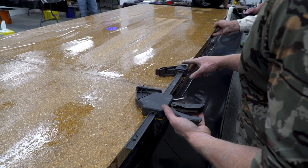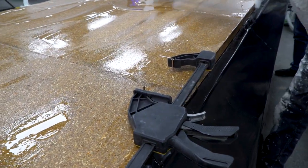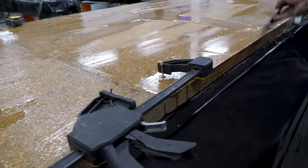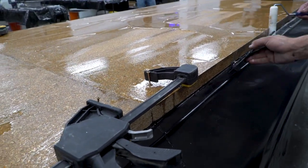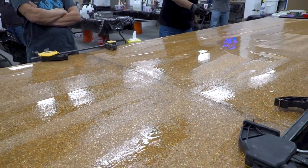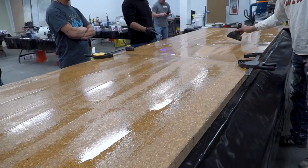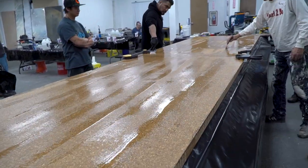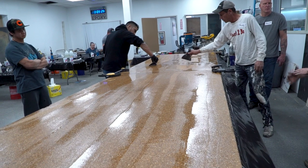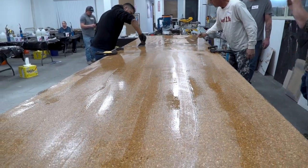Are you talking about that painter's plastic, the roll tape? Yep, and I usually run a piece of 2-inch frog tape right up on the bottom of the, right under my countertop, right at the top of my drawers. So that's like my first cut in, and then I stick that plastic to that, and then I sandwich it with 1 or 2 inch frog tape again. So I have a double layer frog tape up at the top, and that's kind of sandwiching, and my first piece of tape drapes halfway up my cabinet, pulled out onto my floor, and that overhangs my heavy gauge plastic, and then my second piece kind of goes over all that.